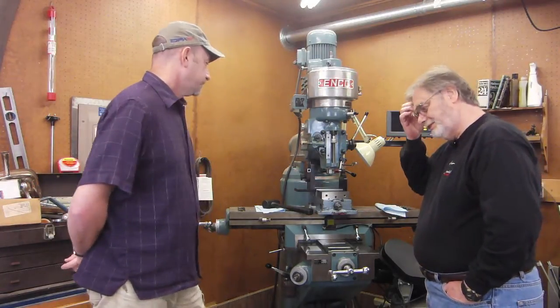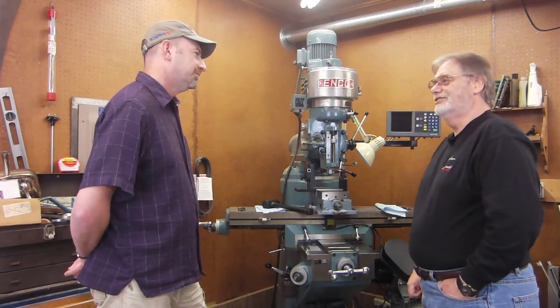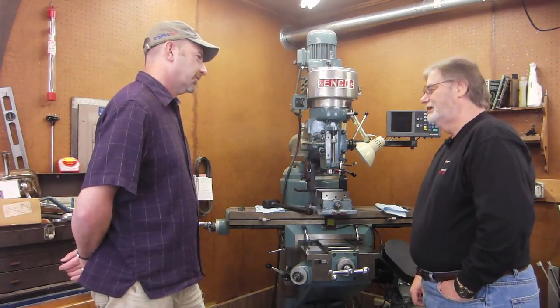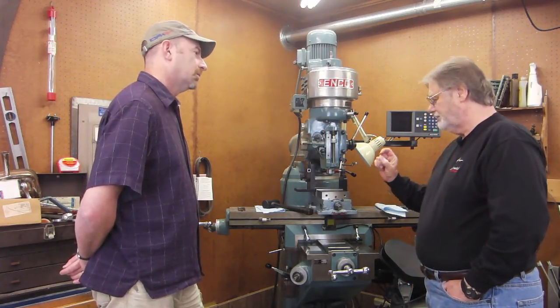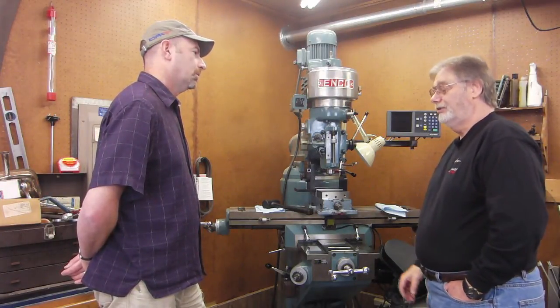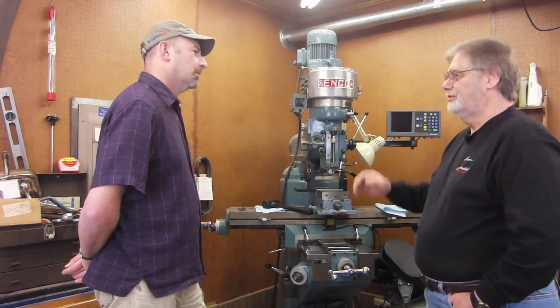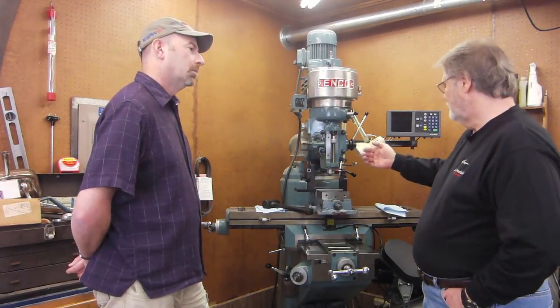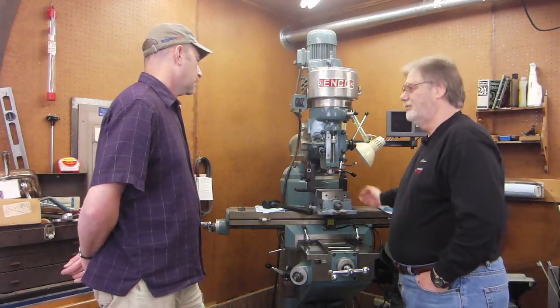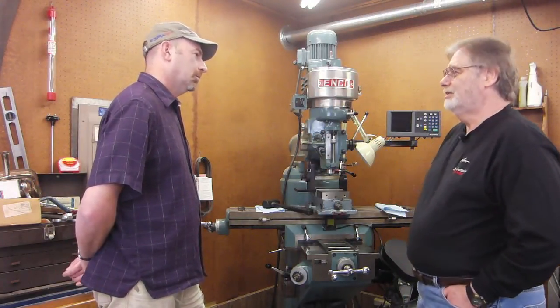They're thread mills. They're carbide. They're very nasty looking. They're very aggressive. It's just like a little 3/8 inch, a little tiny one, to do the longitudinals, and a 3/4 inch, and it looks real nasty, to do the radials. And it's got to be bigger so that you can clear the tooling in the fixture when you're feeding the cutter into it and then swinging the frame.